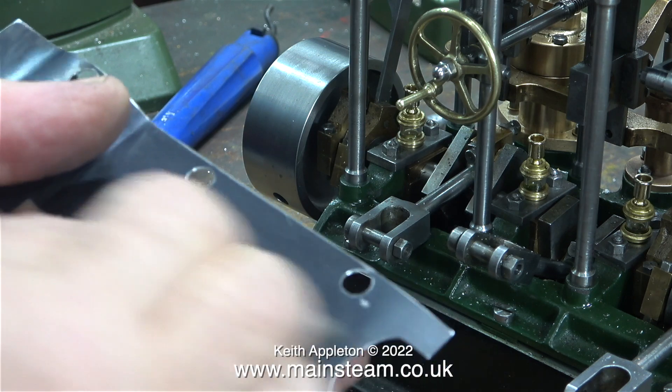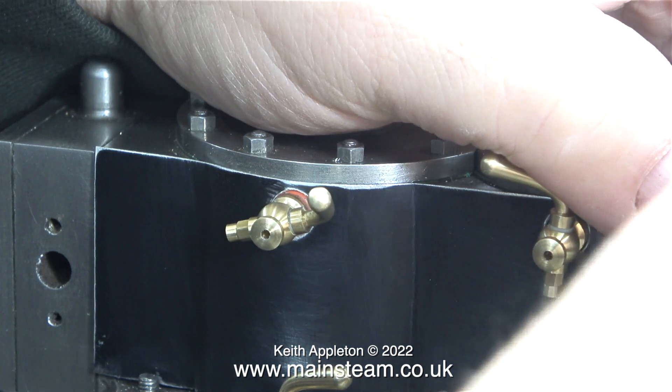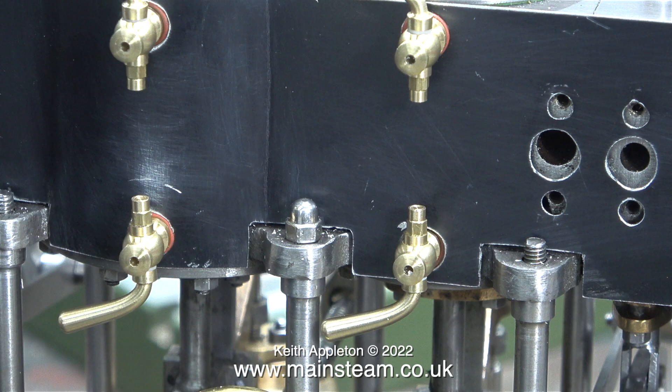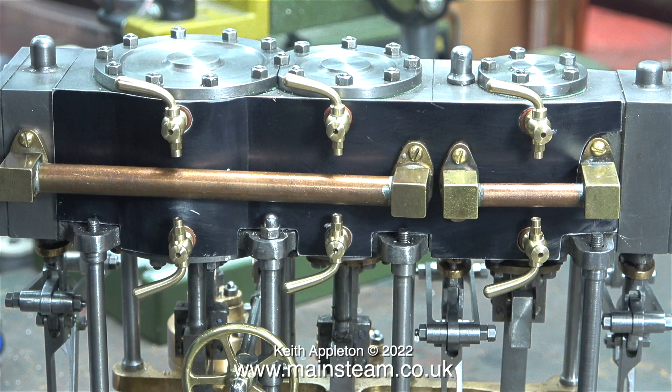I've decided to paint this piece of metal, so here I'm using some 400-grit wet-and-dry sandpaper to score it ready for the paint. This clip shows the temporary fitting of some red steam-grade silicone O-rings on the threaded part of one of the drain cocks — as you can see it fills the hole perfectly. The red doesn't look too good so I'm going to use black, but the black silicone O-rings I have are too weak. I've ordered some Viton O-rings which are a lot stronger, and with some help from Loctite 542 to hold the drain cocks in position I think they're not going to leak. I still need to drill the holes for the 7BA mounting bolts at each end of the cladding, but I'll do that later.